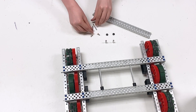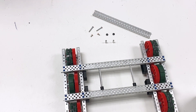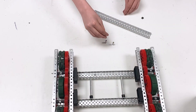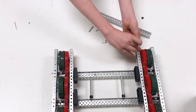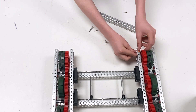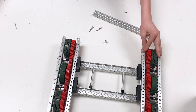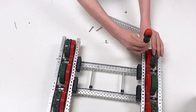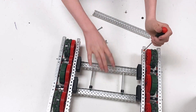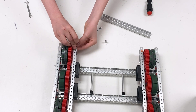You'll also need two one-spacers — the smallest type of spacers. First, turn this over and place the three-eighths screw in the second-to-last hole on the drive base. Slide the three-fourths inch standoff in and screw the three-fourths inch standoff screw into it. Do the same thing on the other side.